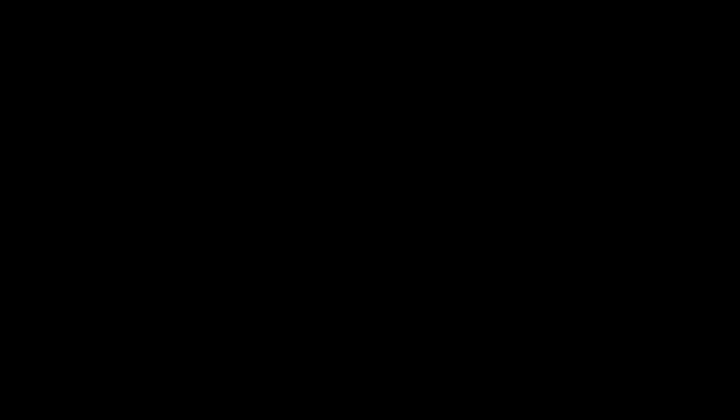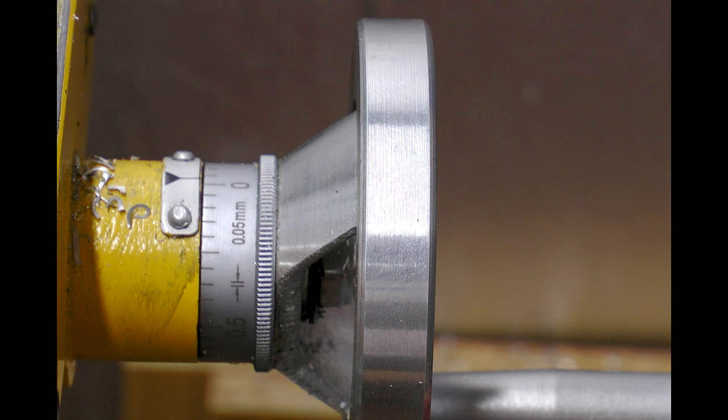I see a lot of printers and people using 8mm lead on their screws - generally 2mm pitch four-start screws, giving an 8mm lead so one revolution is 8mm. For a Z-axis in my opinion that's a bad idea - it's too coarse. I'll do some maths to explain why. In my opinion a 2mm lead is the optimum. Going back to my milling machine and the dial analogy, there's a connection between those small dial divisions and full steps on a stepper motor.